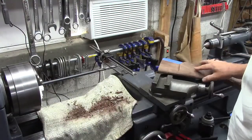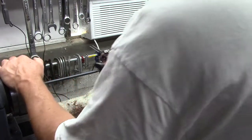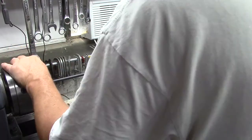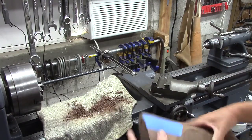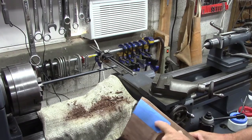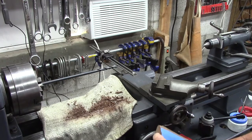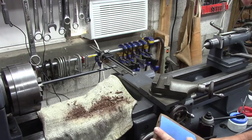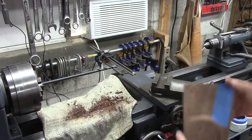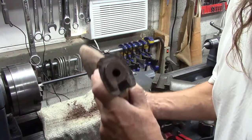All right. Well, I think we're good with the 3/8 hole. Well, no, would have to see if the through bolt lines up. And I might have to do 1/2 inch down there because the through bolt does not go to the end of the stock. So could step drill it up by hand if it's short enough, or I'll have to put it back in the lathe and cut the larger diameter hole. Well, I'll go find out and I'll check back in with you all in a while, but this was an unmitigated, absolutely perfect success.